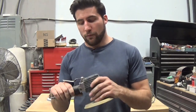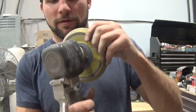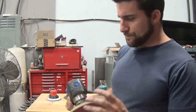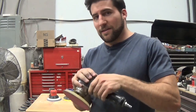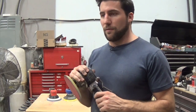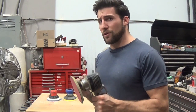Here we have a dual action random orbital sander. This style has a weight on it that spins around, and the pad will spin and also oscillate with that weight, so it's doing a couple of motions at once. This one has a stick-on pad. It's a little bit aggressive for this style and not as easy to control as some, but it's good for doing a smooth finish on a flat surface like a car door. I wouldn't necessarily use it for polishing applications because it is a bit aggressive, but it works well. These types are usually used for sanding metal or body filler.